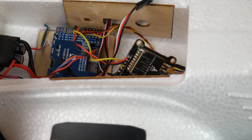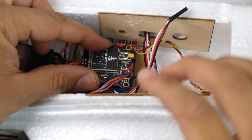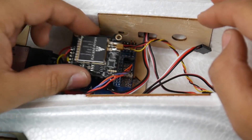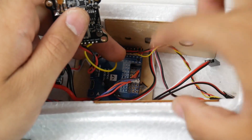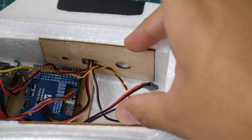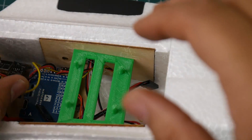The VTX is just hanging here for now, and there are a couple of reasons for that. I can't put it on top of the flight controller because there's a little screw that goes in to hold one of the wings, and I also couldn't make another mount there because the bar goes through the wings in that area. So I designed this little 3D printed piece that takes the exact angle of the fuselage, and you just slide it in to wherever you want after you plug everything in.